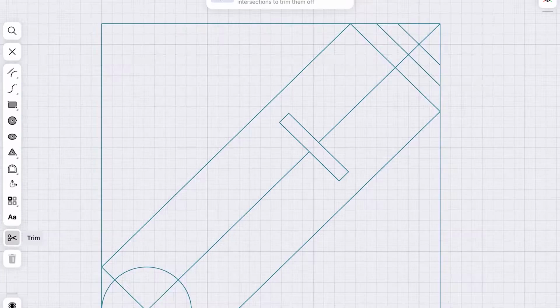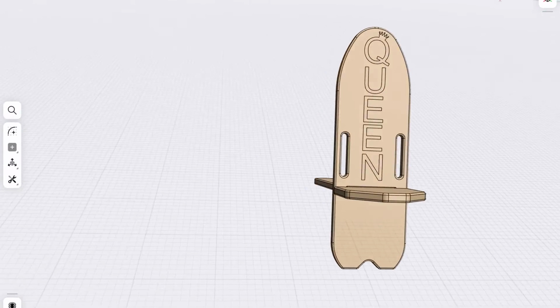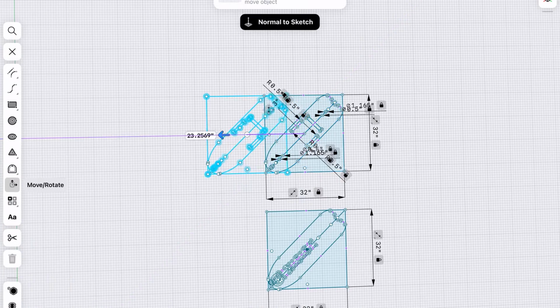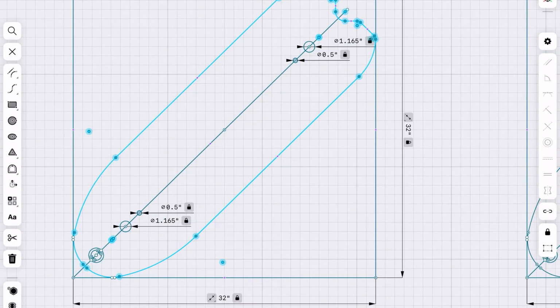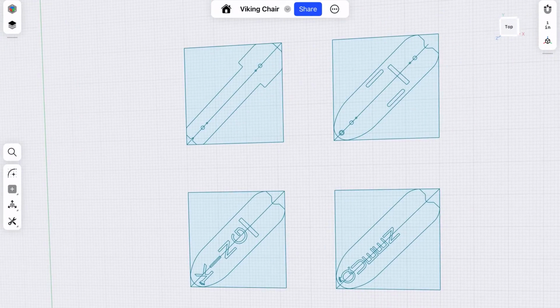The seat is the same width as the back, and it'll stick out by 12 inches as well. The rear leg cuts in by 2 inches on each side, making it 8 inches wide. To make sure that the magnets and dowels on both parts line up, I just copied and pasted the whole vector, then just swapped out the vectors specific to one part for the other. All right, now that we have all of our vectors, let's get this thing toolpathed.